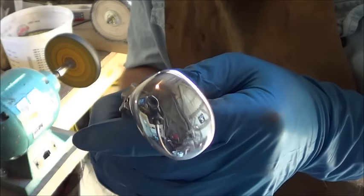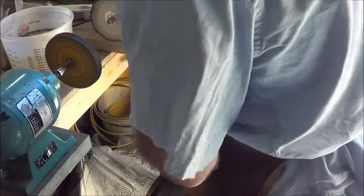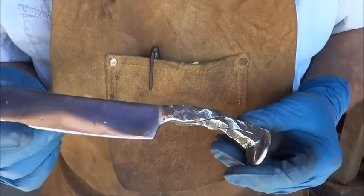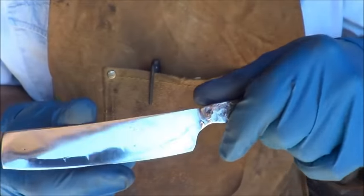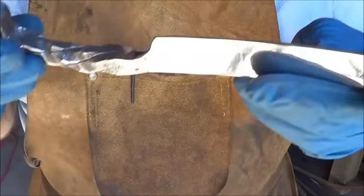There's the first one - not bad, huh? After the buffing wheel - two greens, two whites, softer wheel, right down to a luster wheel at the end. I put a heck of a lot more time into this than I wanted to. I'm not sure this particular tool needs to be quite so shiny. You've got to watch out though - once you decide to go mirror, every single blemish is going to show up. So you either have to accept that people have to accept this is handmade and not perfect, or you need to be very careful on your grinding.